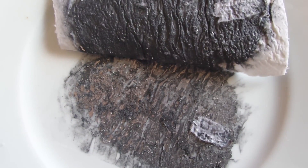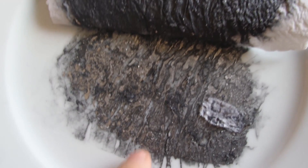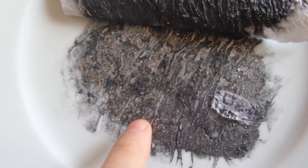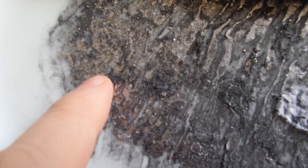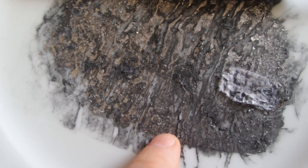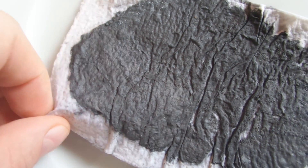The super capacitor experiment did not work. The lower electrode was eaten away when I applied voltage and current to it. I don't know if anyone can see it, but this aluminium was totally eaten away. I had on top this toilet paper soaked in concentrated salt water.